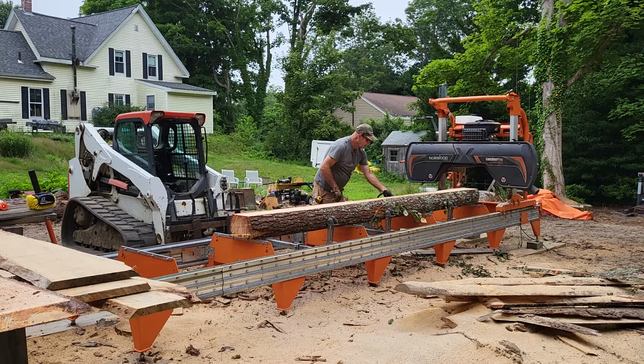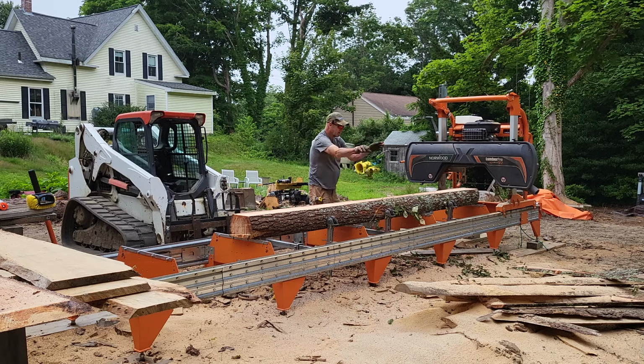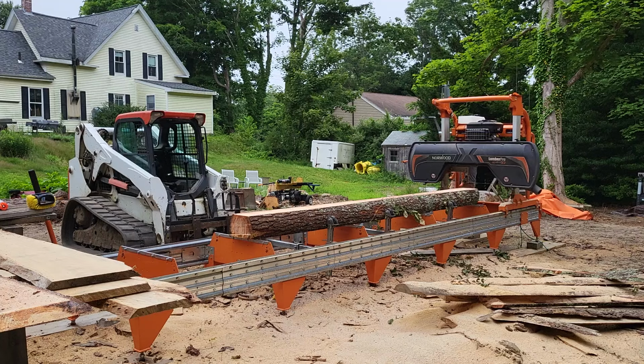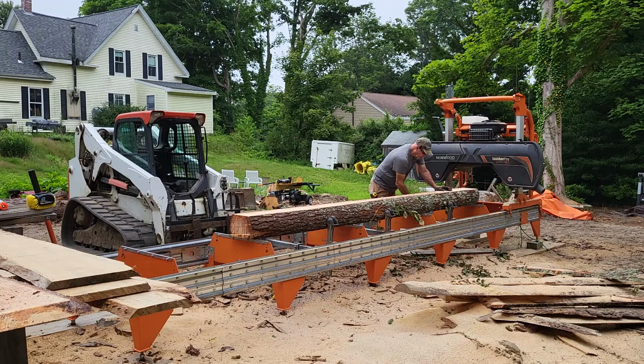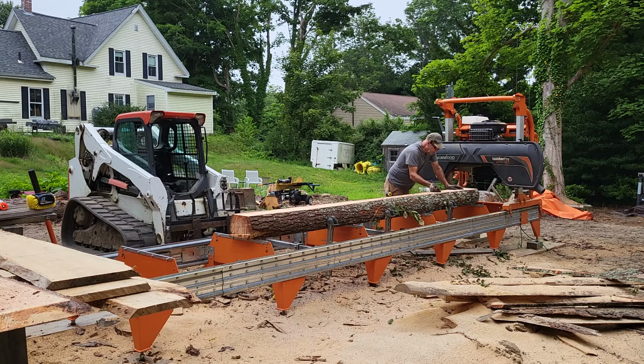Or I could try even take it the other way. Let's see where 8 ends up on 4-inch scale here, you know, 1-inch scale. So 8's, it doesn't work out bad. 8's kind of high. So we'll see if we can get it to 8 inches wide the other way. Because I could take another skim cut if I wanted to get to 4-inch scale. Actually, I can go ahead and do it right now and then try to mill it on 8-inch the other way.